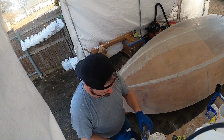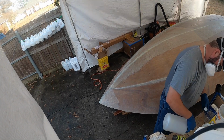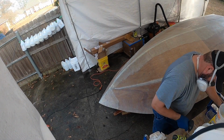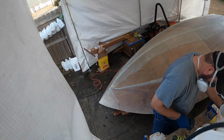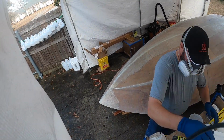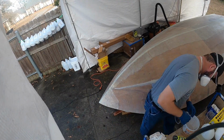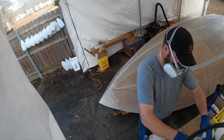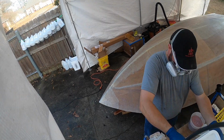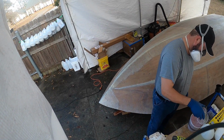This is kind of the first screw up, and I've said I was going to show the good, the bad, and the ugly. So this is a 3-to-1 medium cure epoxy, and I tried to mix a real small batch of it just to kind of see how it would go. And I say small, it's probably about 12-14 ounces of epoxy. So for that you would add 24 ounces of fairing agent. So that's what I have there, and then as I put it in there and I start mixing it up,